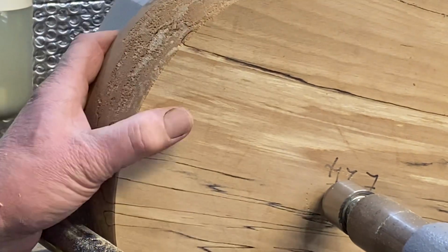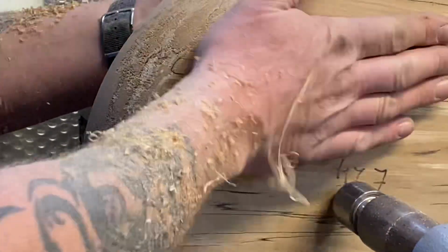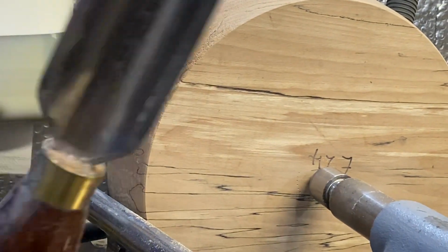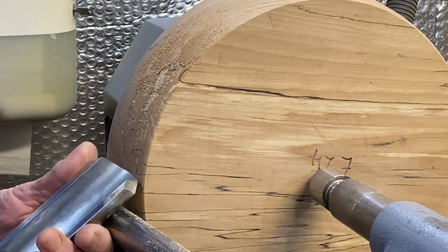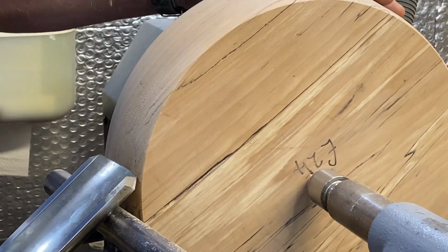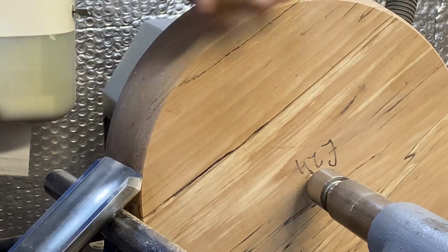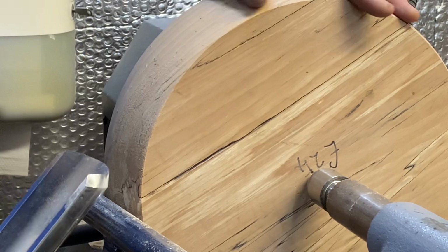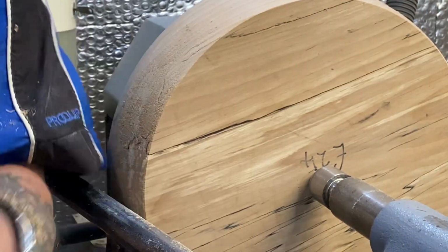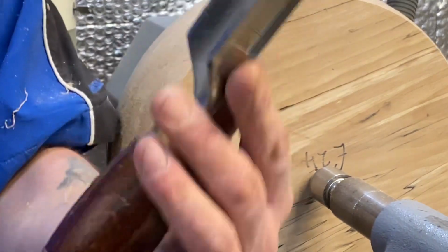Now, again, you could use your square carbide, but in all honesty, because this is a bowl blank, let's get it straight. Never ever would you use one of these, okay? Never that. Because it will come round when it gets to this side and the grain's coming across, you see the grain's running, it will pick that up and try and rip that whole side off. You get a very nasty catch. So never ever use that one. What is that one? That's your spindle roughing gouge.